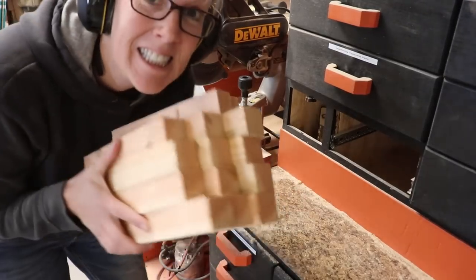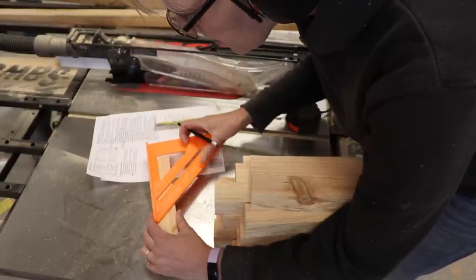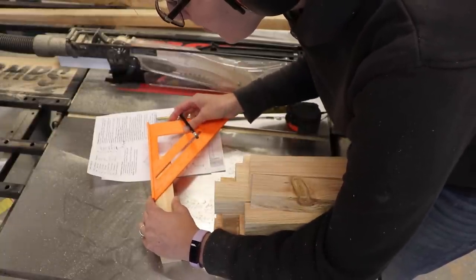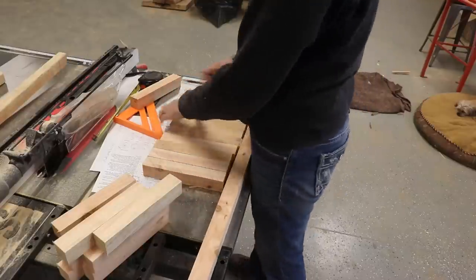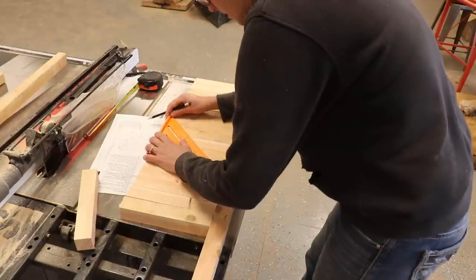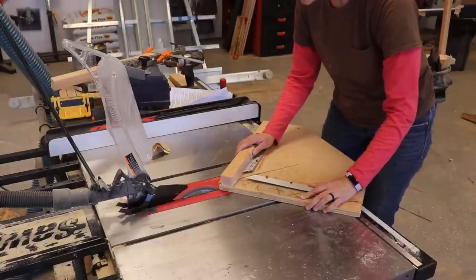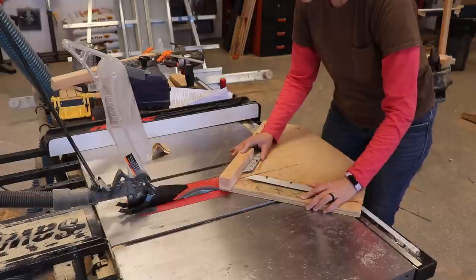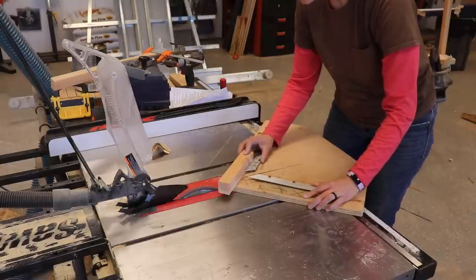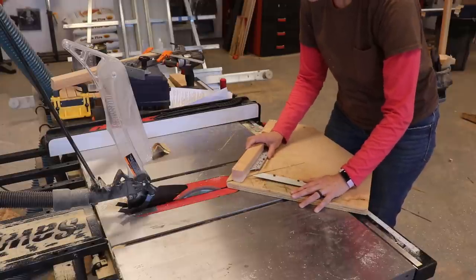I had to cut 16 of these, and then make diagonal cuts in each one along the length of each piece. I started the hard way by marking each individual piece, but then laid them all out together and used a speed square to mark a whole bunch at one time — that worked really well. I used my frame jig to cut half an inch deep along each of those lines. The thing is, the directions didn't say I needed to do half of them one direction and half the other, so I cut all of them the same way, not realizing this was going to mess things up later.